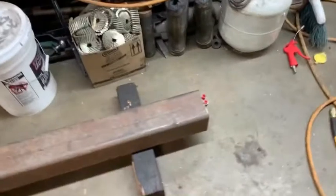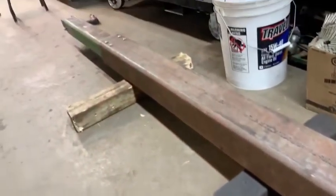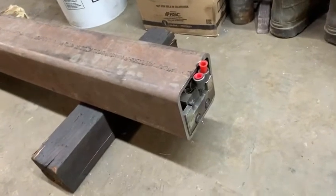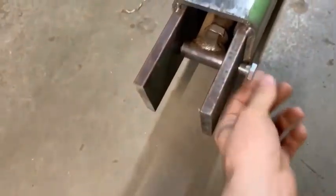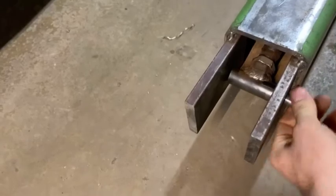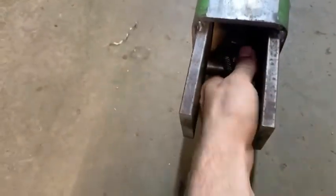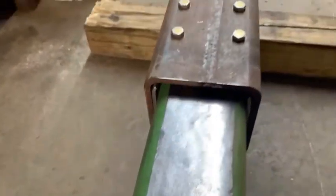I'll show you all how I did this. I do apologize if the audio is a little weird — I've been a little bit under the weather and recovering, doing pretty well, but the last couple days I haven't felt the greatest. So I do apologize for that. Let's get into it. First of all, this is the end of the hydraulic cylinder — I've been running it on air pressure just because I don't have my hoses all set up yet. I've got this half-inch bolt that threads into this side, which is tapped half-inch bolt thread, and it just fits through there. These three-eighths bolts — four of them, grade eight — are tapped into the slide piece, and that piece is also the stop that keeps it from sliding out.